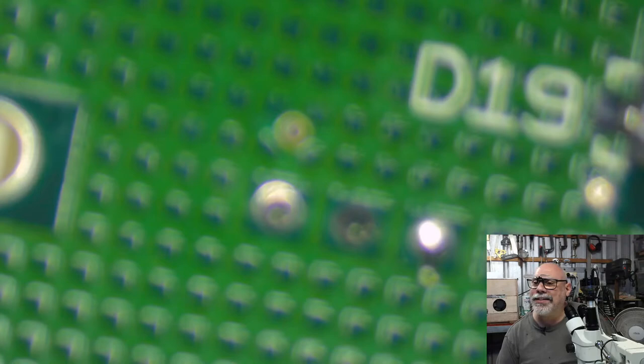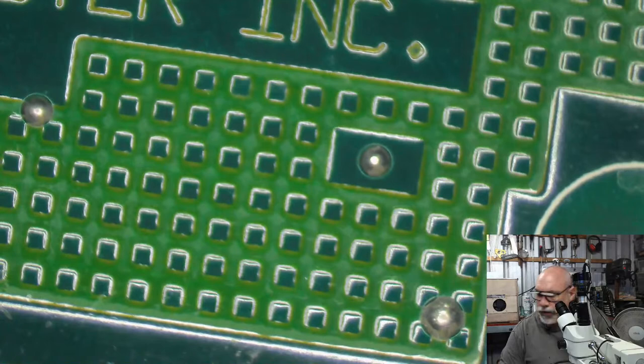Sounds okay, that's good. Whoops, I was talking about the Power Mac board a few messages back. Oh, sorry about that. Recently recapped the Power Mac 8100 board. It was pretty bad cap wise. One fell off, don't have a video adapter, can't test it much. Now the 8100, yeah, okay. Yep, fair enough. I've got an 8500 here. I do believe you can use the same power supply with those, but yeah, unless you've got the little video adapter, there's not much you can do.